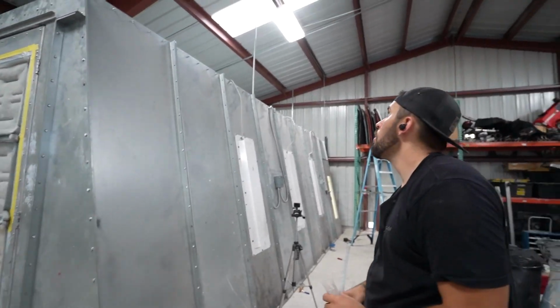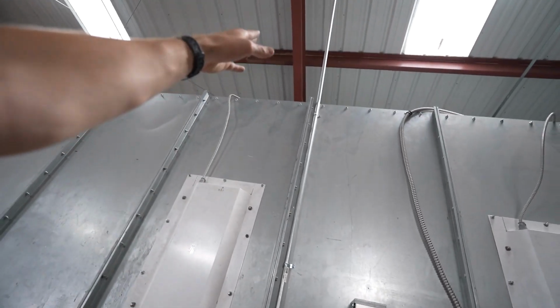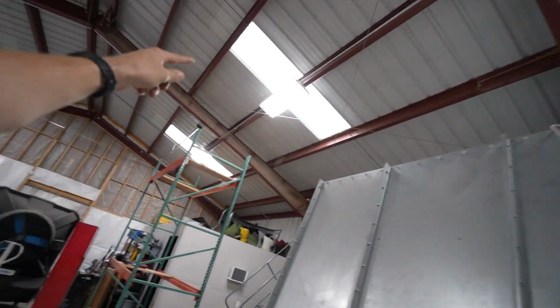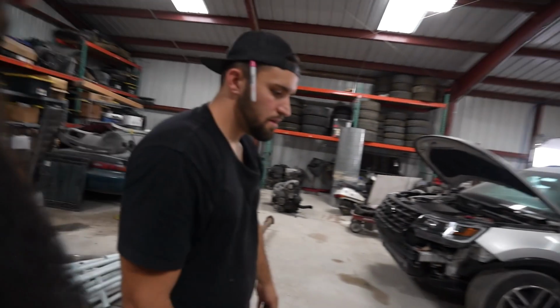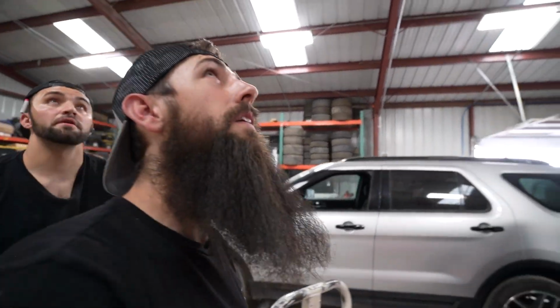So did you show them the whole operation? No. So Sean went ahead and got all this. He bent the tube, conduit, went up there 90 straight down. There was already a junction box up there, and actually the guy who wired this place left an extra circuit in there that wasn't wired up to nothing. So that was really courteous. No, that was really nice because we thought we were gonna have to buy a bunch of wire.